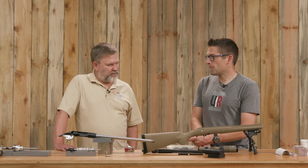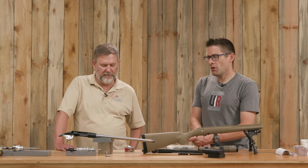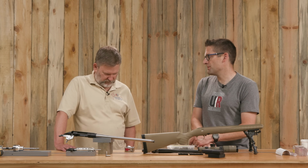Ruger. And it's the same as Winchester and I don't remember who else. There are two or three of them, like the Ruger 77, which is another one of their models. So that makes sense that they would repeat that. An inch and a 16th is another popular diameter. 16 threads per inch for factory rifles and 18 for customs.